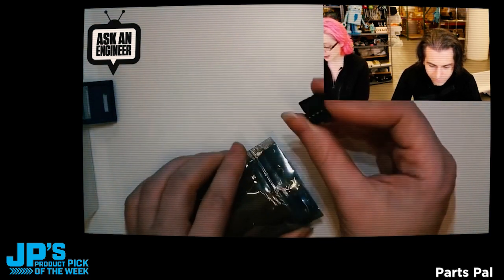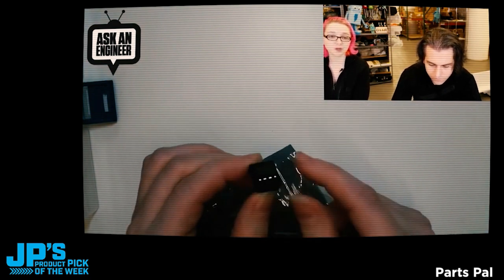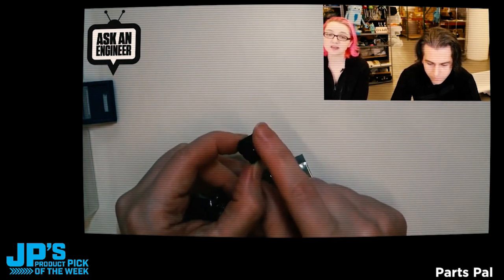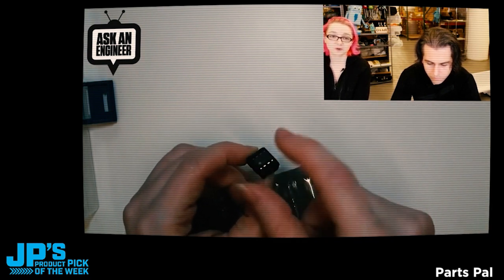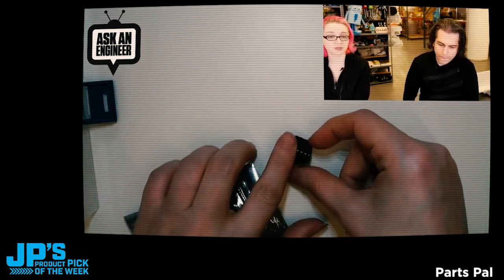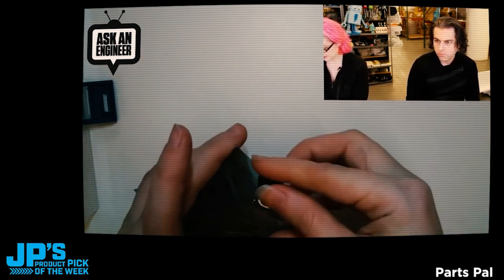And then finally, TLC555. So this is a wide voltage range and low current 555 timer. I really like this particular 555. It's a little more expensive than the NE555, but it's CMOS, not TTL. So it comes in foam, and you can run off of batteries. You can run off of a AAA battery even, which is really nice. And I think it goes up to a megahertz. So okay. Great for all sorts of timing needs.